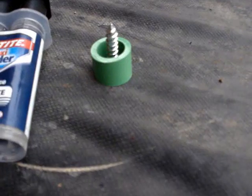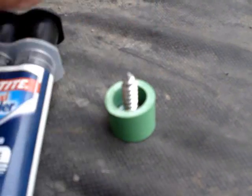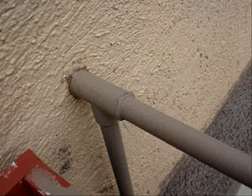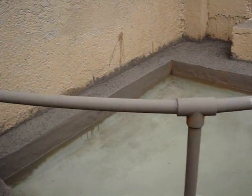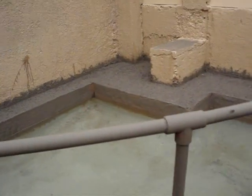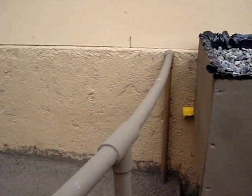This is how I connected the PVC to the wall. I just took a couple of scrap pieces of half-inch pipe, epoxied screws in it, and screwed this into the wall. Then I stuck the T fitting onto that and glued it on — that is how I secured it to the wall. The rest of it is just simple T fittings and half-inch pipe, running it around to each one of the holes in the concrete. And this is how I made the frame for my fence.